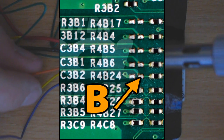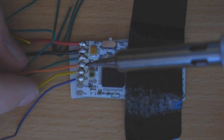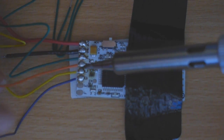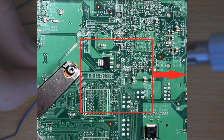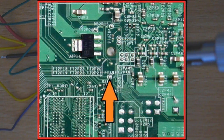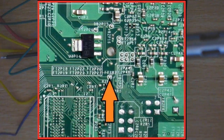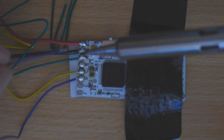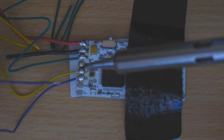So there's actually an alternative point on the back of the motherboard that you can use instead of the normal point for CLK, and I think I'm more comfortable with doing the one on the back of the motherboard instead of this one. So I'm going to take this off, and I'm going to attach another blue cable from this blue cable is from the RGH2 hack.